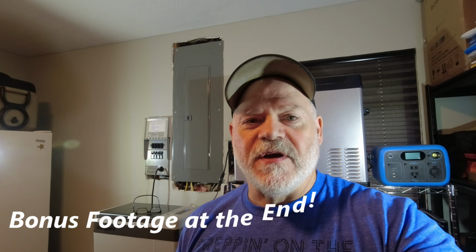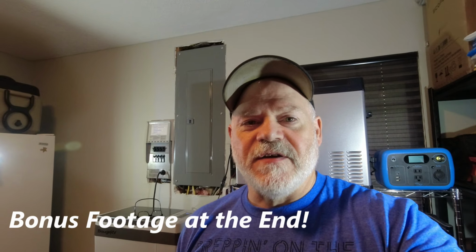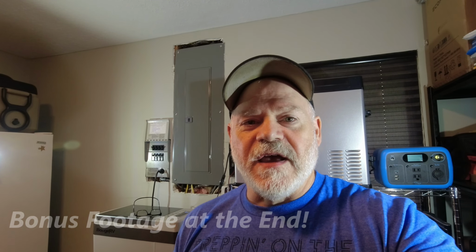Today we're going to be adding 3,840 watt hours to our battery capacity. We're going to make a DIY system that's going to live here in our solar room, and stay tuned because here it comes. What we're going to do is take 3 LiFePO4 batteries and put them in parallel.